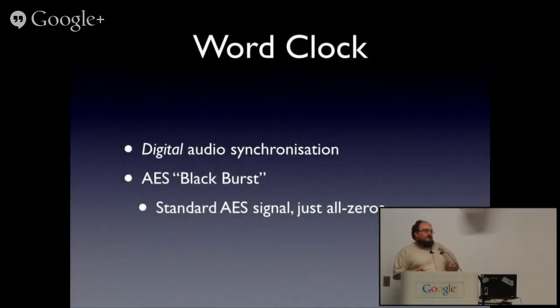And then with digital audio, something got created called word clock, which is to ensure that all your digital audio analog to digital converters and digital to analog converters are running at the same rate, which doesn't seem like it would be a problem until you've got 60 channels on multiple boxes that are synchronized in various odd ways. So the way that actually works, even though it looks like it's a BNC cable and coax and doing strange things, is it uses a technology based on the AES-EBU, Audio Engineering Society, European Broadcast Union, digital stereo audio standard, which is actually almost identical. If any of you have used SPDIF or TOSLink on your home stereo, they're exactly the same except for a couple of bits. And that's used essentially just as a straight frequency synchronization.